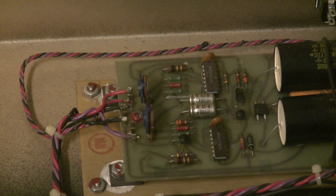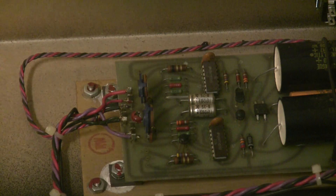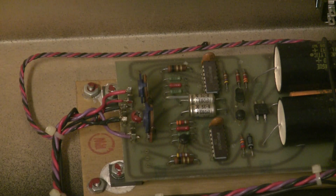So I'm going to turn the power on the synthesizer — I hear some crackling out of the speakers. Now I'm going to measure the voltages to the power supply: black lead going on the black wire, red lead going on the red wire, so we're measuring the 15-volt bus.